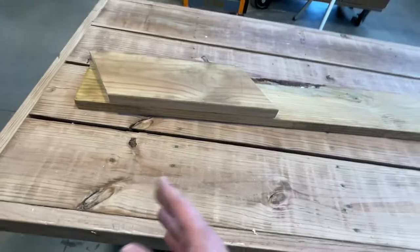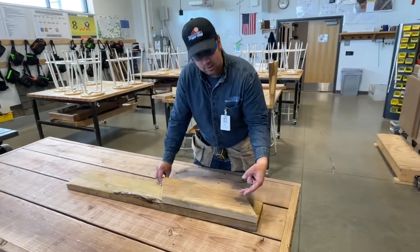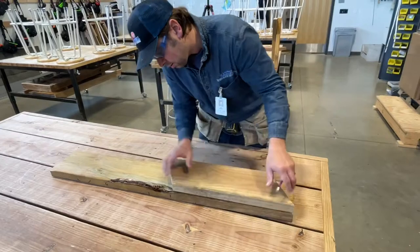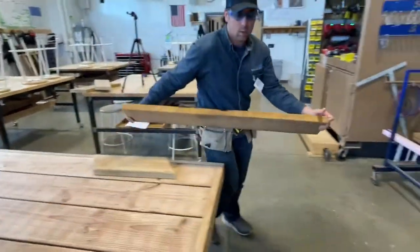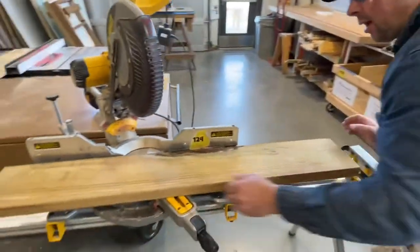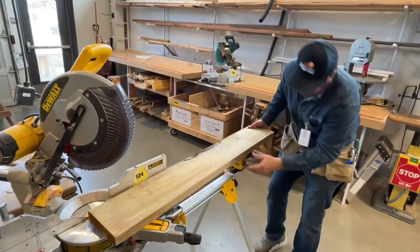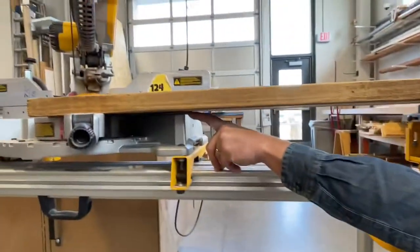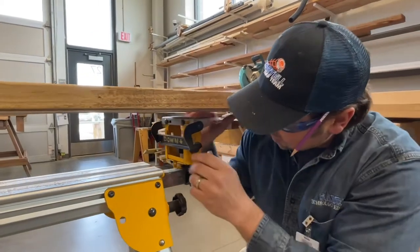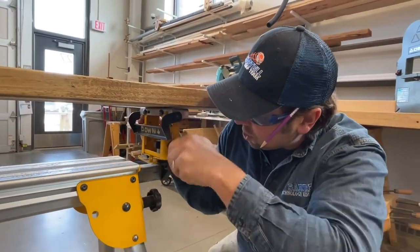It's probably not good for a bench top — it's actually a little bit short. So I can lay this out and cut this for a bench leg. I've already got one piece that is a known good, so I can use that as a template. I'll flush my edges on both sides and then mark where my 30 degree cuts need to be. I'm going to bring this over to my 30 degree saw. I'm going to cut this joint first. I'll come down on my level — I'm looking right here, there's a gap, and that's a problem. If I flip this down, now it doesn't sit level on the table. It really needs to be supported about right there, so I have to adjust these. Normally I will do this prior to class so that this holds the material exactly where it should.